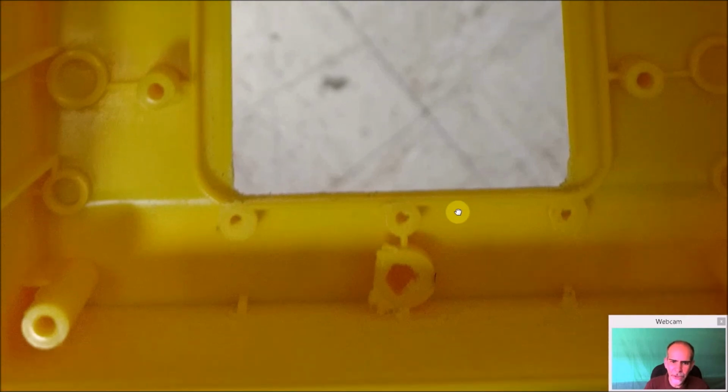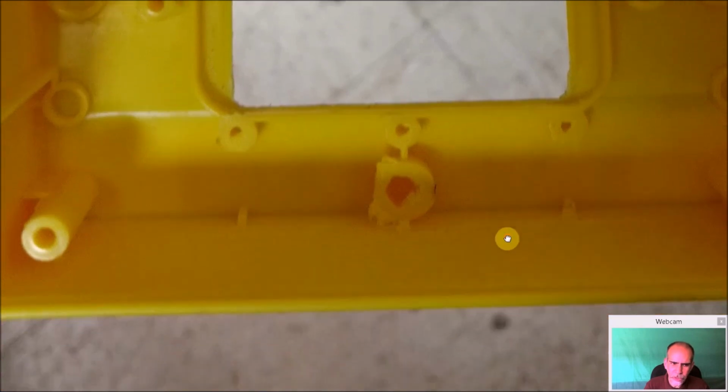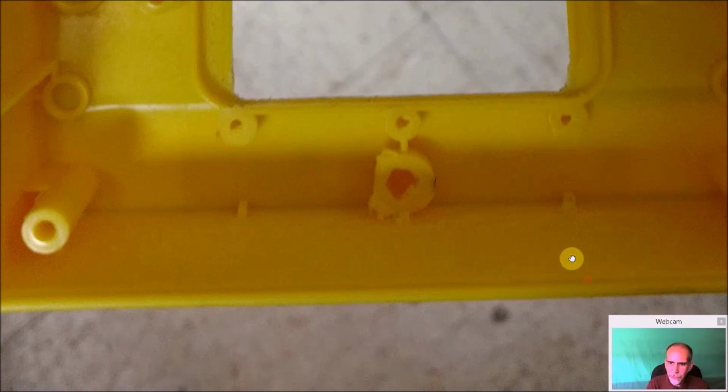But you can see here, these were cut, again, with the rotary zip. I just went straight across and then filed them down a little bit to make them smooth so the screen can lay across. And this one also has to be cut out. And you can see these were all the way up top. I cut them off. And I know it's really hard to see, but I used almost like a barrel bit and steamroll cut across a couple of times to make this thinner. I know it's really hard to see, but this has actually been gouged out a little bit to make the screen fit.